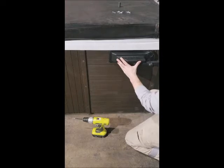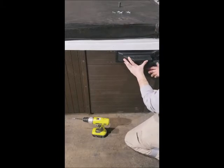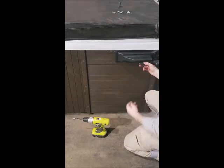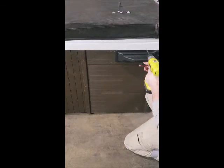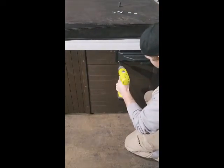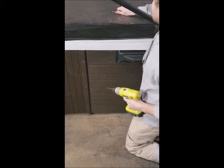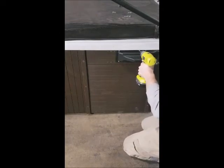Now we're ready to mount the bracket to the sides of the spa. Line up the bracket using the horizontal edge of the acrylic, then slide the bracket back towards the vertical strip — the vertical strip will stop the bracket where there's no more room. The easiest way to connect this is to start with the four corner screws so the bracket is held in place, then finish up the remaining screws. If you want to pre-drill the holes you can, but it's definitely not necessary. Bring the pivot arm out of the way so you can get to the screws underneath.